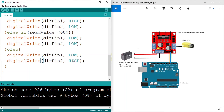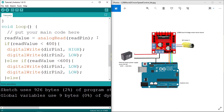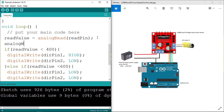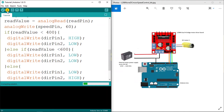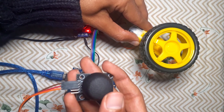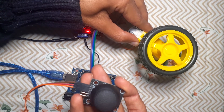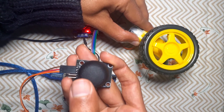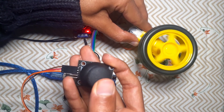We're missing the speed of the DC motor — we can set a speed up here using analogWrite, giving it speed_pin and a value of 60. Later we'll use the joystick value to control speed, but for now let's hit upload. Moving the joystick to the right, you can see it is rotating; in the middle it stops; and we can also move it to the opposite direction. The speed is the same throughout right now.